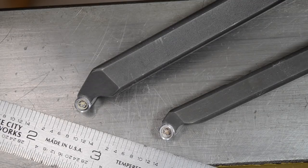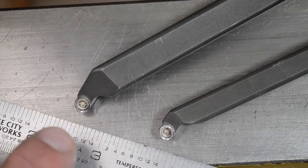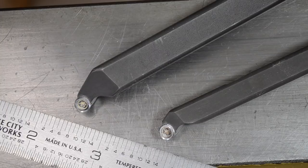Good morning. I'm going to do a little demonstration of the new Hunter Viceroy tools. The Viceroy tools are fairly new on the market. The larger cutter is a half-inch shaft with a six-millimeter cutter. The smaller one is a three-eighths inch shaft with a six-millimeter cutter. I find they'll cut pretty aggressively with that small cutter, but the small cutter also tends to leave a better finish.